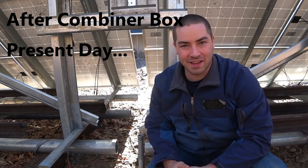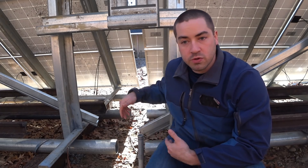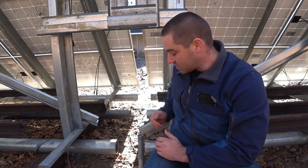I ran into a little bit of a snag — I think some water got into the conduit and froze overnight. To clear that, I pressurized the conduit from the garage side, blowing warm air through it. At first very little air was moving through, then it picked up and started spitting water into the combiner box. That's why I took the combiner box off temporarily at the expansion fitting. It has now stopped spitting water and air is blowing through like crazy, so I think we're cleared.